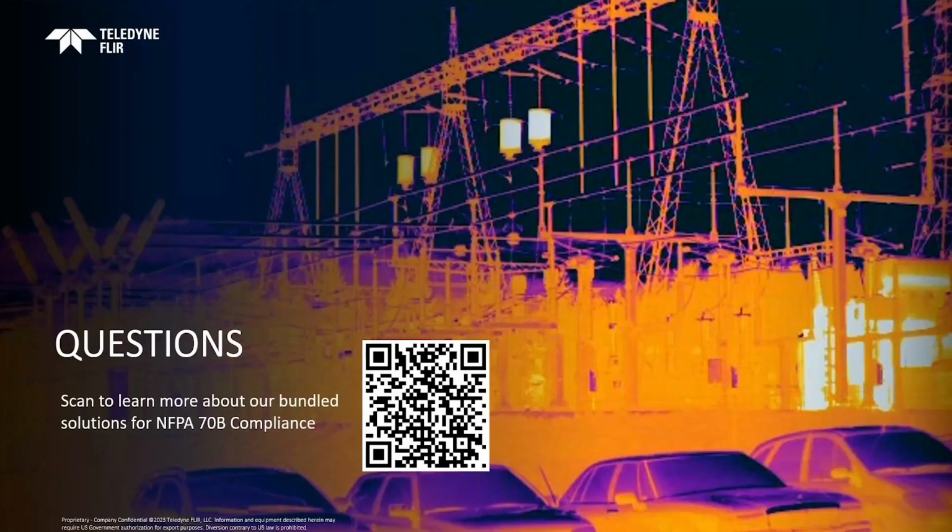At the Infrared Training Center, or the ITC, we really focus on two lines of training. One is equipment that we train on: the infrared cameras and the meters, like a multimeter, like a current probe, where we want the students, whether it be a level 1 or a level 2 certification course, to become more and more familiar with understanding how the camera operates. How do you calculate a delta T? Where does the data go for the current probe or for the multimeter doing contact resistance? So training on the equipment itself.